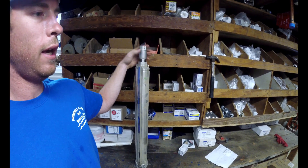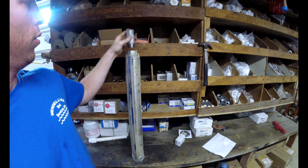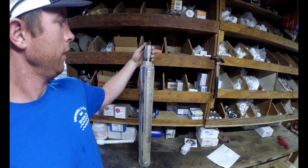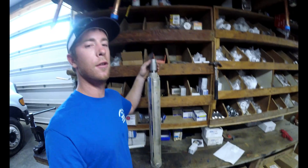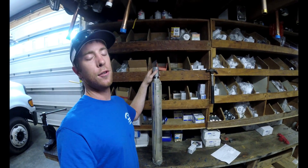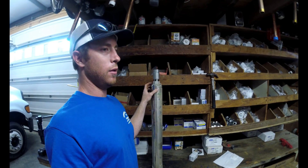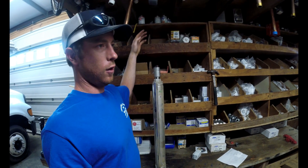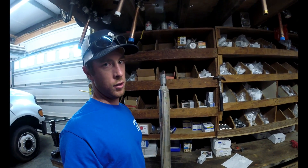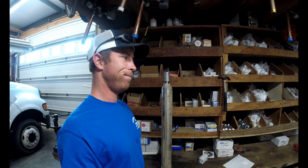It's also an additional check valve — you can see it here. It doesn't cost a lot of money, but the number one thing you don't want to happen is to have your check valve fail. A lot of times these pumps will have a check valve built in, but if it fails, every time your pump cuts off the water leaks back down into the well, which can cause more problems.